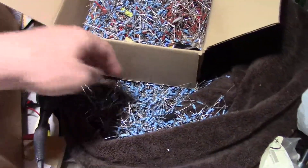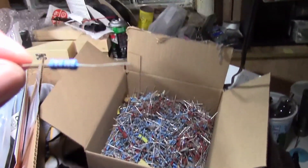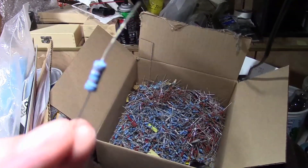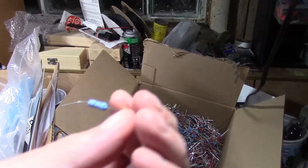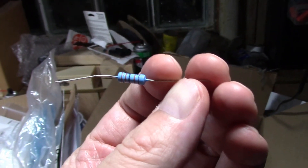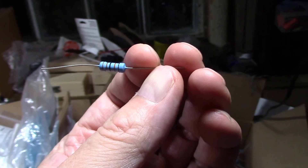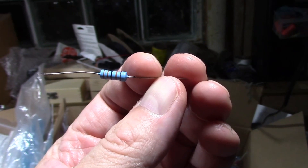But I've got a few issues with them. One, while they're blue and a little jarring when you look at vintage electronics with these bright blue resistors. Also because they're one percent they have an extra color band, so if you're not used to seeing this - this one is orange, orange, black, orange, brown - what the heck value is that? Well it's 3, 3, 0 and then three more zeros, so it's not 33k, it's 330k, and that brown stripe means one percent.